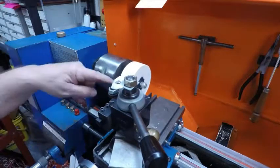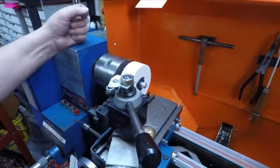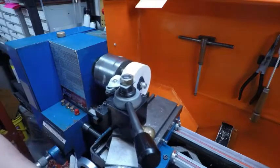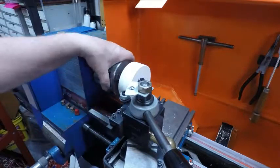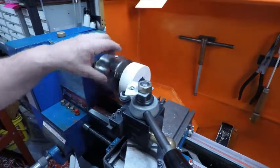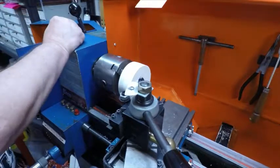That stuff's going to cut nice. I've got a carbide tool in there — tool steel would cut this plastic. There is so much you could use this stuff for. I'm glad I came across it. I could even probably speed it up. See, it's only hitting. Boy, it looks beautiful. All these marks you can see — if the camera picks it up — is from when it was around the can. The oil and that it left, but as soon as I cut it, it's solid. It's nice. Let me speed it up and see where I'm at. First of all, let's see what speed I'm on. I have a thing up here I can put on and check it.